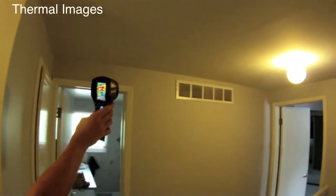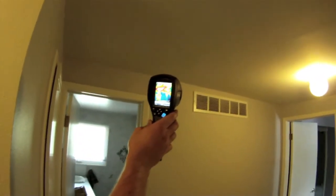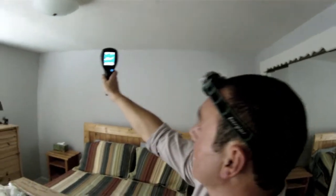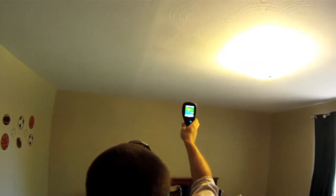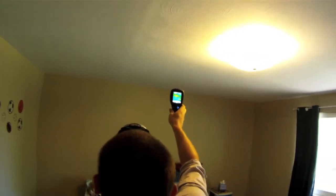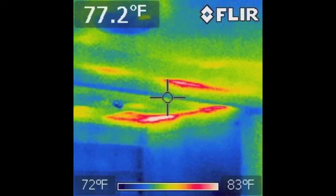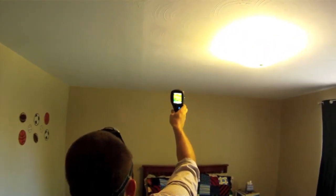Insulation issues because of how they cut in that return line — there's a good picture of that with thermal imaging. Big open area. Areas like that show a lack of insulation. This is the kiddo's room — a couple of areas where it just looks like the insulation is failing. Dead red means there's none. These little yellow spots right here in the middle — I only have an 11 degree delta right now, but it's still showing some temperature variation.